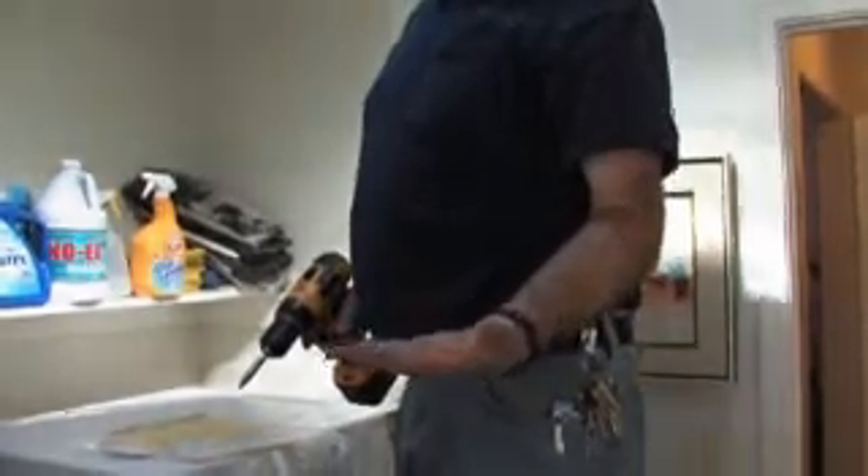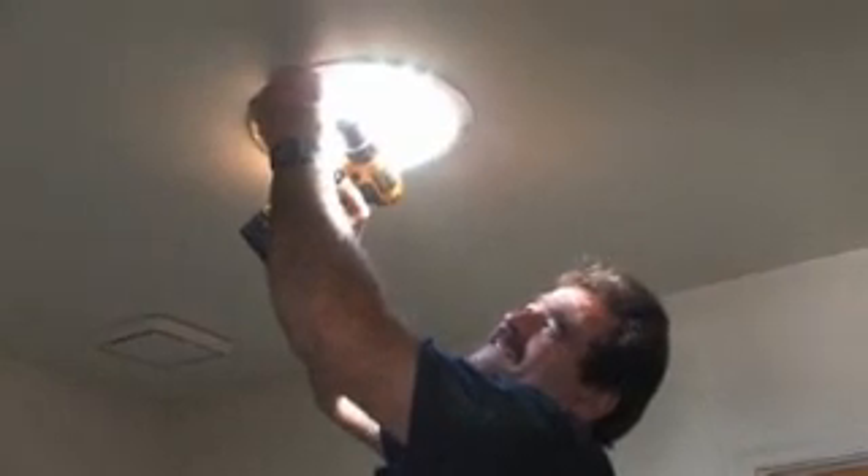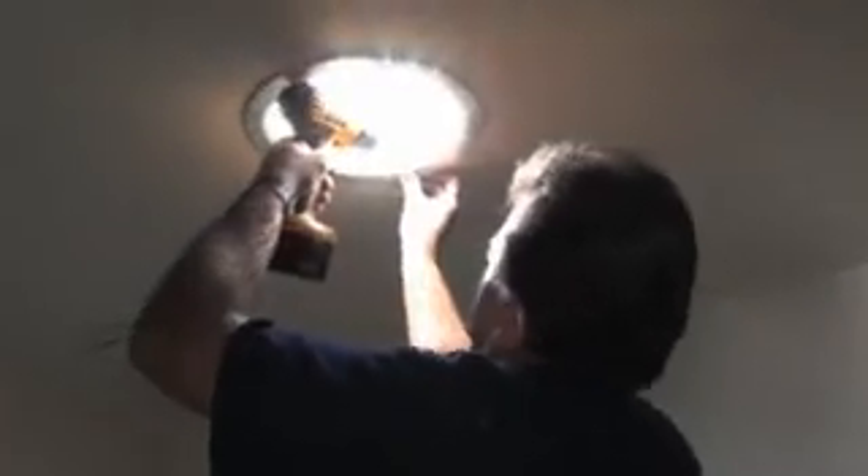Go downstairs and finish up the trim ring down below. Now we have to attach the pipe to the trim ring down below. We're using the two little self-tapping screws — screw them through the pipe into the trim ring. One on each side.